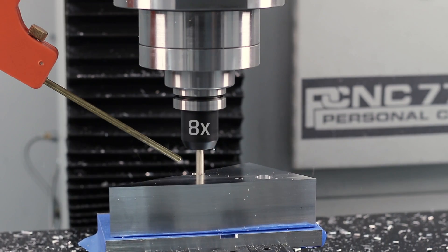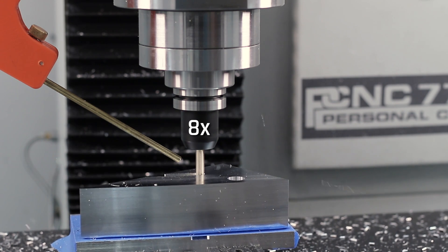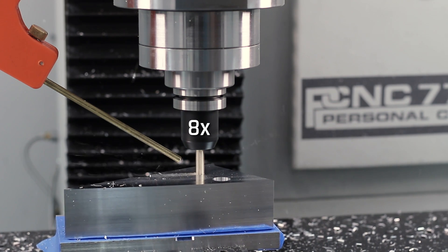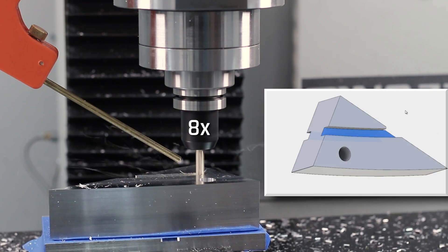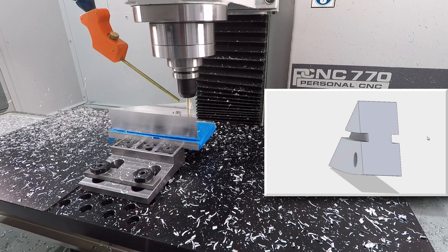Tool 31 to do the same adaptive for that slot on the back side. One of the features that was critical was to maintain accuracy of locating the slot on each side and having them be located correctly relative to each other even after we flipped it.